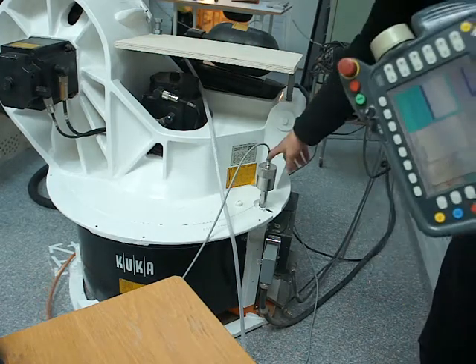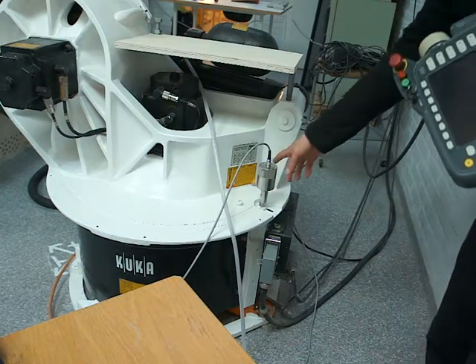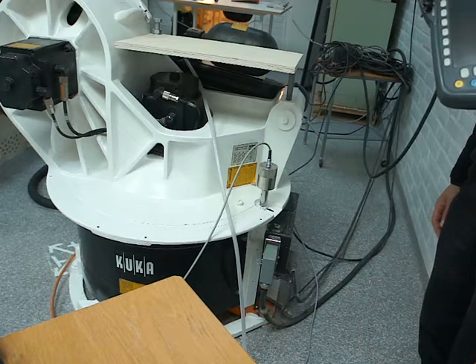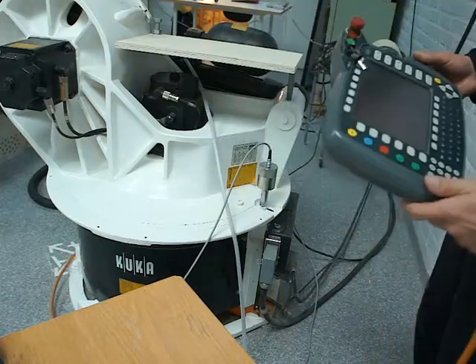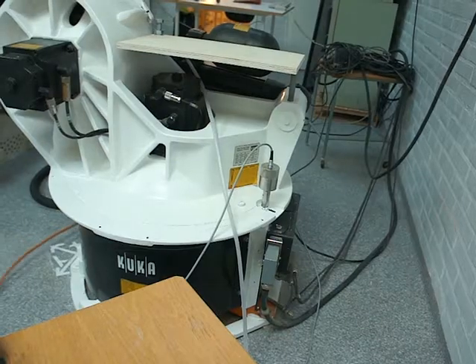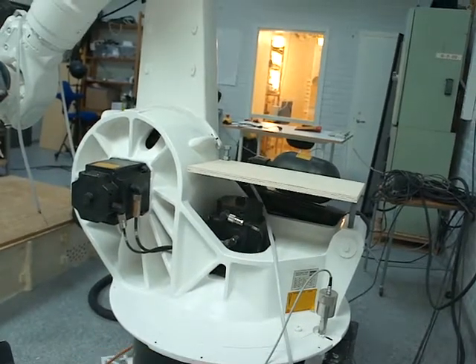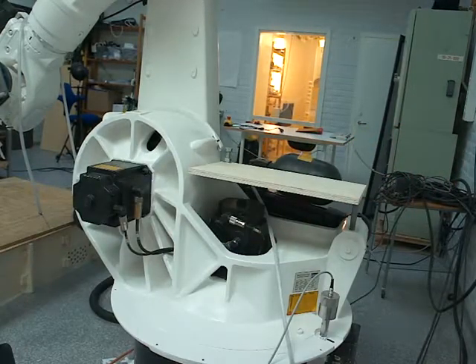I say mastering and we go again. Now I see the green lights on the tool — one green light, then two green lights, then one green light. And then it's done. Now it says no axis to master, so axis 1 is mastered. The same goes for the other axis: align those points, move the EMT, and press the green button and so forth.